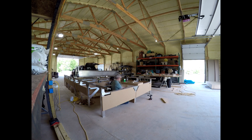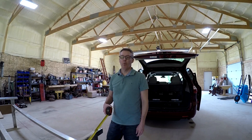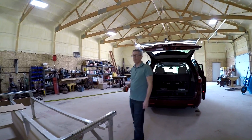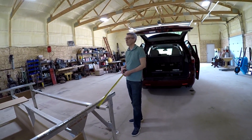I'm fastening the panels about every 3 inches, starting on the two ends of the side I'm drilling and then going to the center, putting fasteners at the midpoints between the ends and the center. We're going to see how square this machine is. At this size you should expect it to be a little off, and if I get it perfectly square I'll be very surprised.